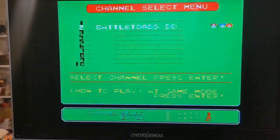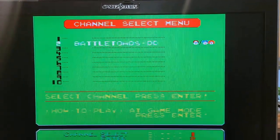And fortunately, or unfortunately, I should say, when we press the enter button, you can hear some humming in the background, and it appears to be playing, but it is all glitched out. So this is what's happening. It looks similar to a RAM-related error, which it very well could be. It could be the board, the game itself, or it could be the actual motherboard. I'm not sure, but it does seem to be playing in the background as well. It's hard to tell, and I really don't know exactly what this would look like normally.